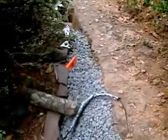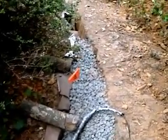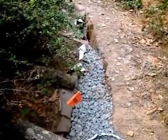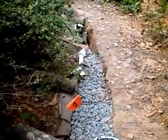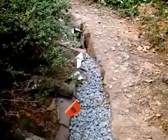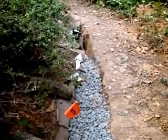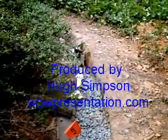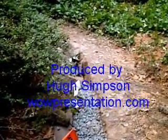And the other thing is if you get to a point where you can't get the water to drain down, put some sand and some rocks underneath it, and that'll raise it up, and that should give it enough. And then with the compression of new rocks, that should give you the exact angle you need to finish it off. And that is a French drain.